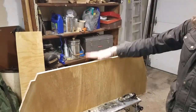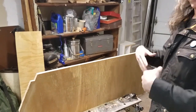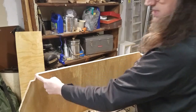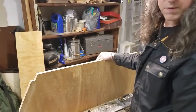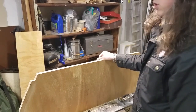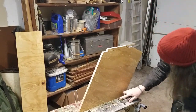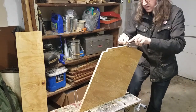Because this, this, and this, these are the edges that are actually bearing wood when we're assembling our boat. So those are the three that really need attention from the plane. And then in here, these notches are going to need to come down, and I don't have a plane that can deal with those, so I use a chisel. I'm not great with a chisel, but I'll show you what I do. This one got a little close, so I'm just going to...